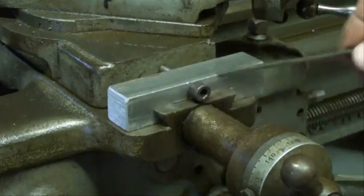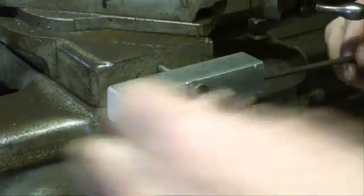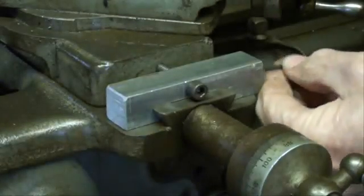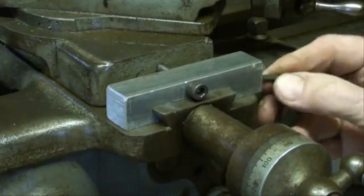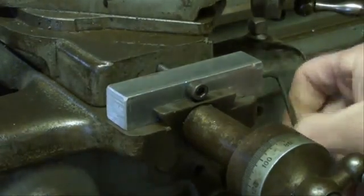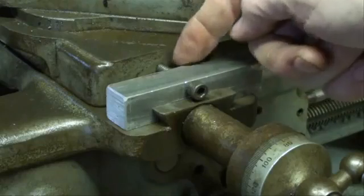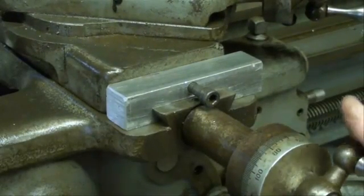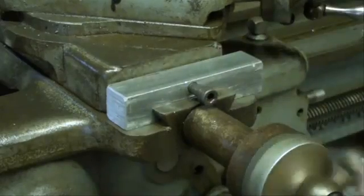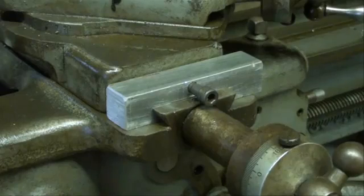Now I'm going to take the other Allen wrench and tighten it. You know, could be any place here. I'm going to tighten it in this position for now, just for the sake of conversation. Now, when a fella embarks on a threading job, he can set this any place he wants it, and it can be set as a stop in the direction coming out, or, watch this cap screw here, as we come in. So we got a double stop.